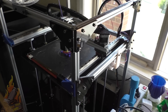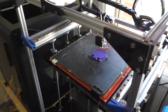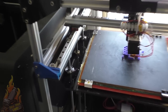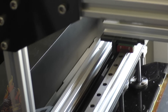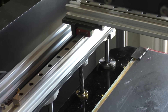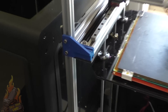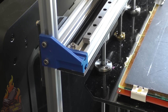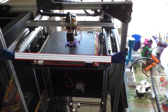To fit this R2 conversion it's basically a total strip and rebuild. This printer had been a workhorse for some time, so it was a great opportunity to pull it all apart, strip it down, clean it, re-oil everything, realign everything, and put it all back together. The whole process took a couple of days but was well worth it. I've also fitted the front bar removal brackets, available on Thingiverse, which takes away that front piece so you get much better access to your print.